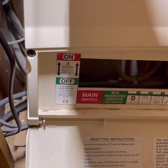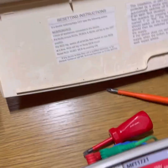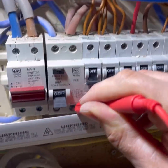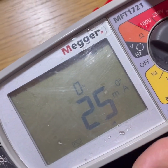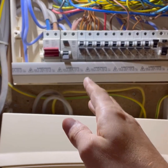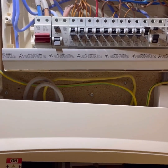I'm going to ramp test the RCD just to prove it. Result: 25 milliamps. When you consider it was 24 milliamps at rest doing nothing with minimal loads, and it ramp tests out at 25 milliamps, that is very, very close. The best option here would be to convert this to an RCBO consumer unit and split that leakage up across individual RCBOs.